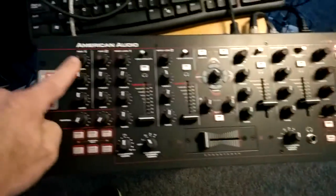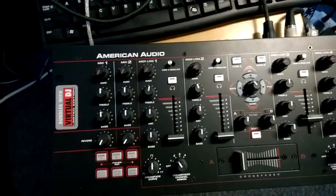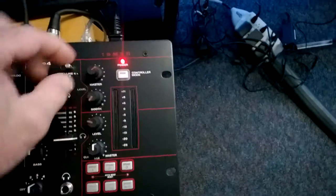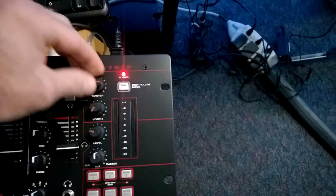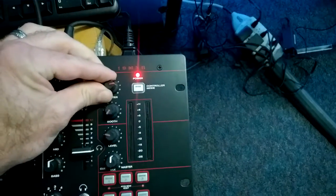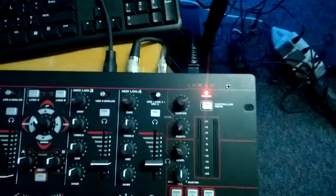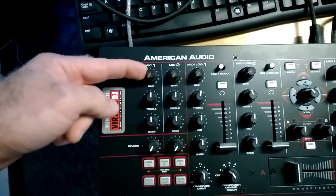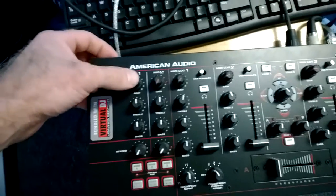Okay, here's the thing I'm noticing. The mic gain doesn't have to be turned up at all for this hiss to come through. It's tied to where the treble knob is. I'm going to take the gain coming out of the mixer on this master right here, and I'm going to leave it about 3 o'clock or about 80% turned up. All I've got to do is activate the mic channel. There's your hiss.